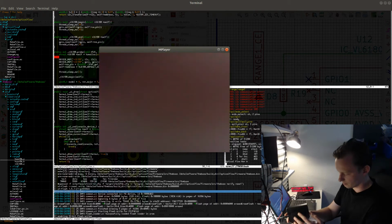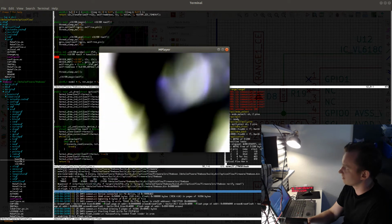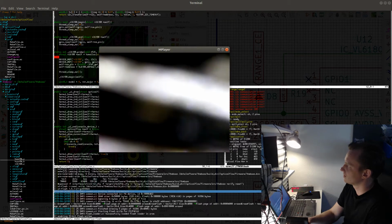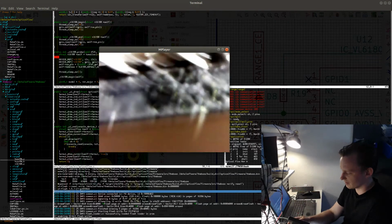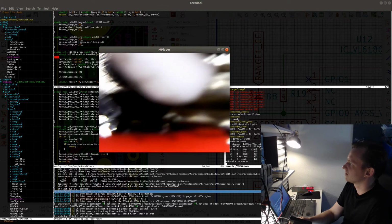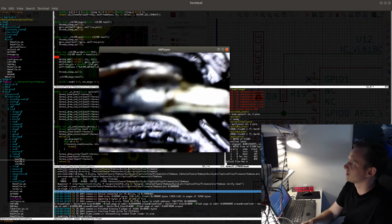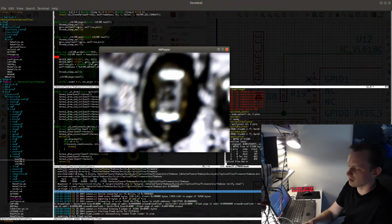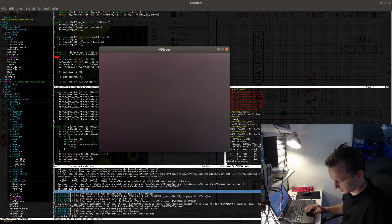Let's see, yeah. This is what the joint looks like on one side. Let's make sure there is no connection between the leads. This is my gigantic, thick wire, and this is the connections that are connected to the jump wire. And then the jump wire goes all the way to the other side of the board and connects to the pins of this I2C voltage conversion chip. And let's see, was there anything else I was going to do here?